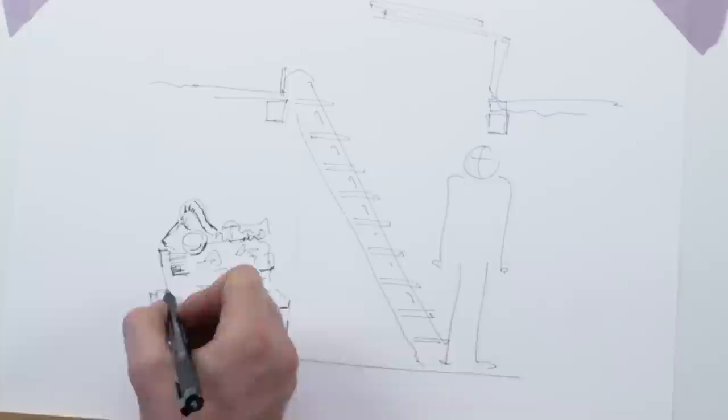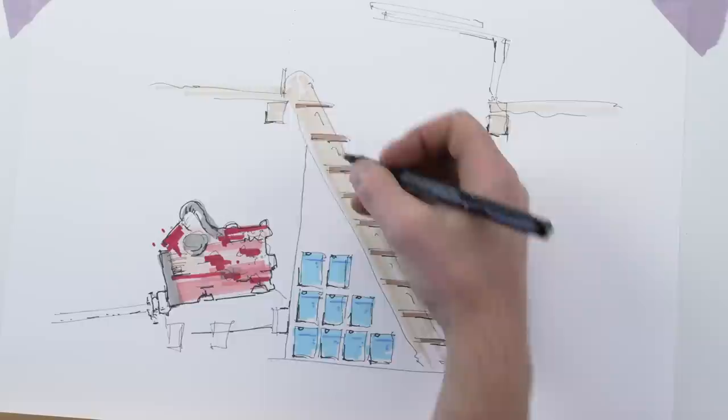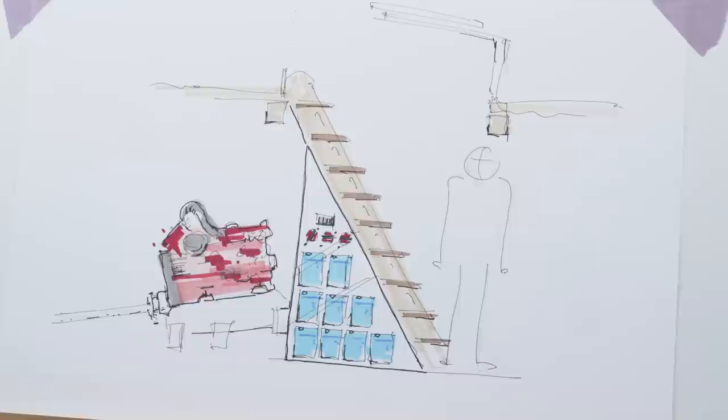Okay, so this main companionway area, the main entrance into the boat, presents some interesting challenges. The batteries, which we looked at earlier, the best place to store them is going to be underneath the companionway steps or the companionway ladder, because we want to keep them all together, we want to keep them low in the boat, and basically everywhere else there's going to be too much other stuff. But the other thing which has to be taken into account is getting access to these batteries. Now, if we imagine the batteries are basically in an enclosed sealed locker between the engine and the companionway steps, the side of that locker is going to be taken up with controls for battery switches, things like that. So that panel is not going to be easily removable.